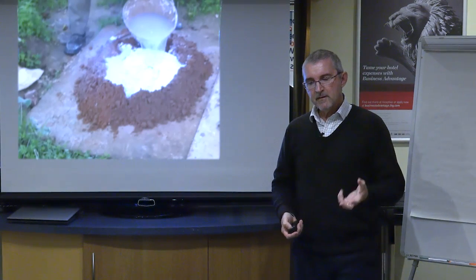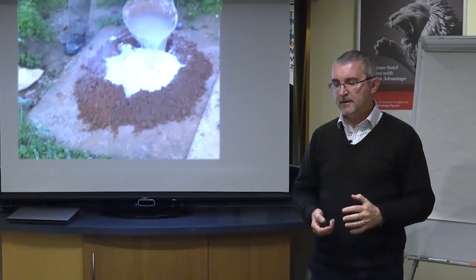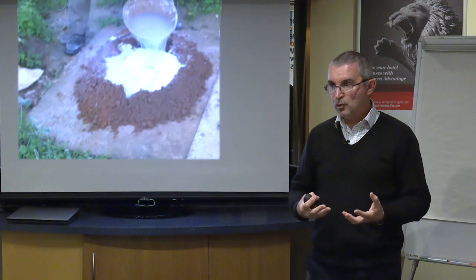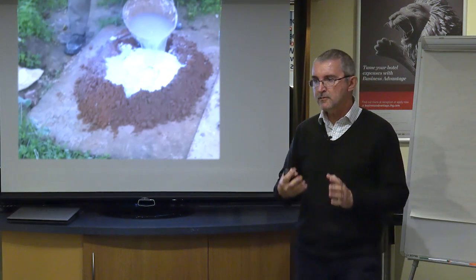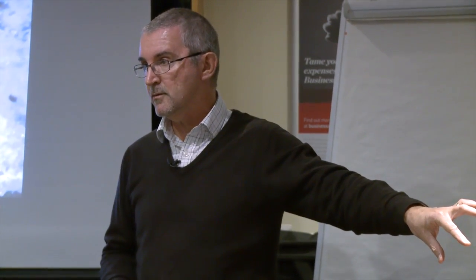So the variation on this slaking, which I explained to you, which is usually done in advance, and you store your lime putty, and the longer you store your lime putty, the better. That lime putty, before that was made into that mortar, was 6 months old. So that mortar is 2.5 years old. The putty that it came from was 6 months old. So actually it's now 3 years old. The longer you leave it, the better.